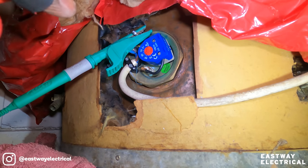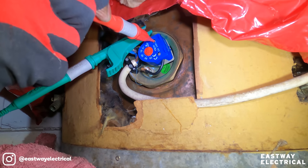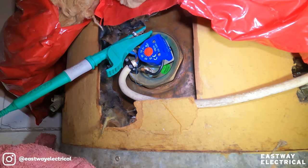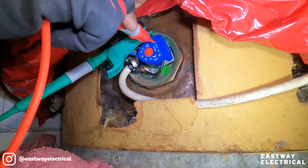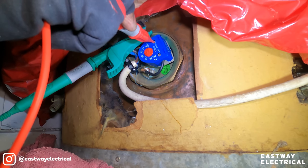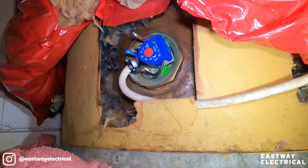A guy wanted to check his immersion heater because it kept blowing or something - it's all good, the plumber seems to have made a decent connection. Now this circuit - you said it was dead, but it's actually alive. I've just turned it off to do a test. That one there is on the timer, which is what I thought. So that's the one on the Economy 7 timer over in the far corner, and the 'unrestricted' one here is for the top immersion element on the normal electricity side.